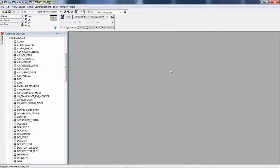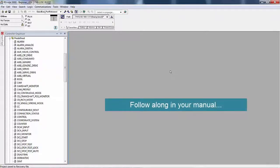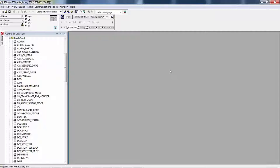Moving on, I've gleaned the important points from the help file for you in the manual. In the future, you should be able to find your own way back to the instruction help files on your own. The one shot instruction, the ONS, enables or disables the remainder of the rung, depending on the status of the storage bit. When enabled and the storage bit is cleared, the one-shot instruction enables the remainder of the rung, or has a true out condition for the rest of the rung. If something else is false to the right of the one-shot, well, the rung's all done anyway. When disabled or when the storage bit is set, the one-shot instruction disables the remainder of the rung, or rather to say, it sets it to a false out state.